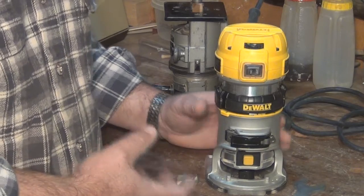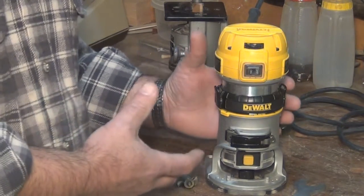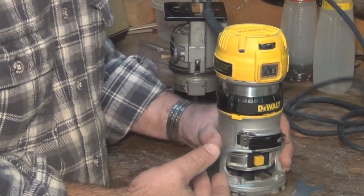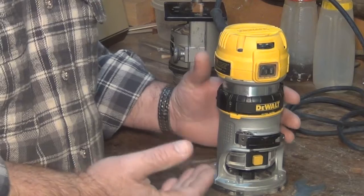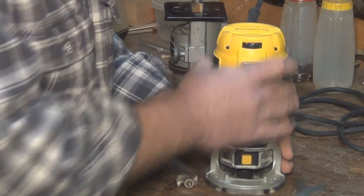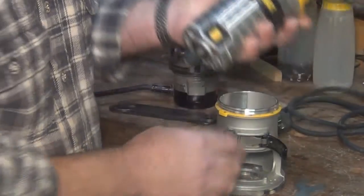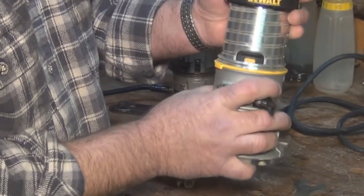Let's start out with the trim router. It's got the same concepts all the way up through the larger routers, but this one's just easy to show. What you're looking for in a router is not only the power and amperage, but a good solid base. There are some routers out there that have fairly weak little bases — they're just not really solid. They'll get a little bit out of square sometimes. This one I like because it grabs the entire body of the motor with this clamp. Very solid. It doesn't move or change its position. It has an adjustment up and down, and also a quick release so I can separate the motor from the base itself.